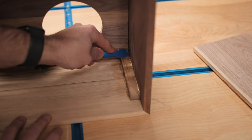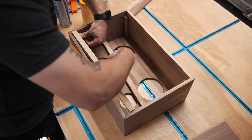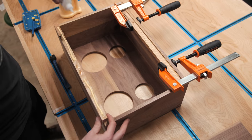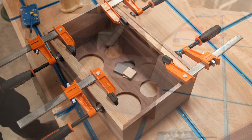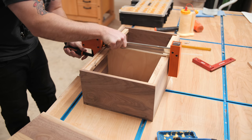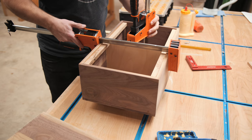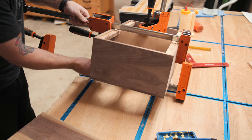I used a combination of CA glue and wood glue to attach the corner blocks — the CA glue held them in place while the wood glue dried. I also needed to add more blocks to the inside of the top and bottom panels; these are where the screws that attach the removable back panel will connect. The last piece to add was the center divider, which I kind of forgot about. I needed to notch out those blocks to make room for the divider, and I cut it out of half-inch Baltic Birch plywood, making sure to use plenty of glue for an airtight seal.